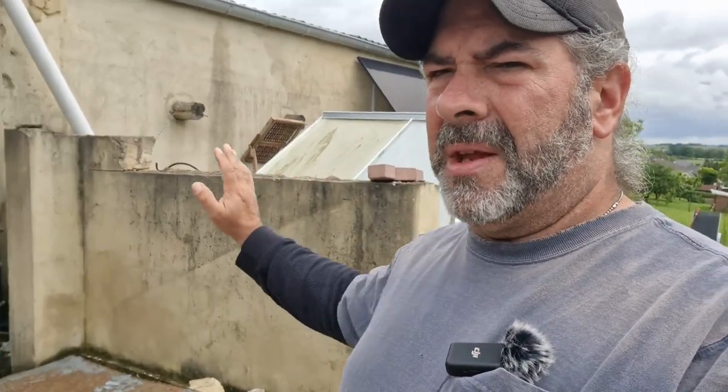The door threshold is probably going to be up about this much because the door is closer to the wall. But I don't want a huge place where you've got to step up over, because that's going to lead to dragging toes, screwing up the threshold and stuff like that. With that said, we'll probably have to raise it maybe a centimeter where the door actually is. So my plan there would be to make a pillow of mortar and actually set it on the pillow of mortar. This end is way too deep to do that. So we'll work this all out.